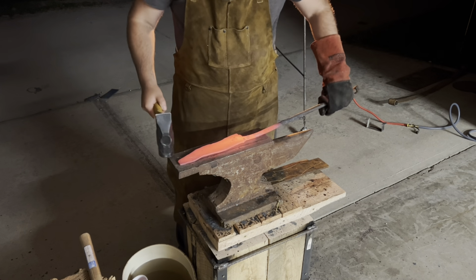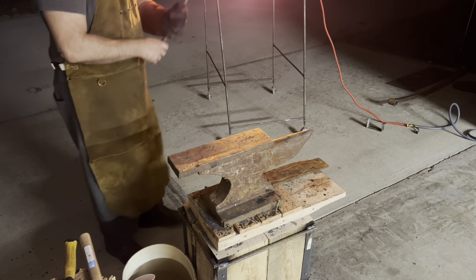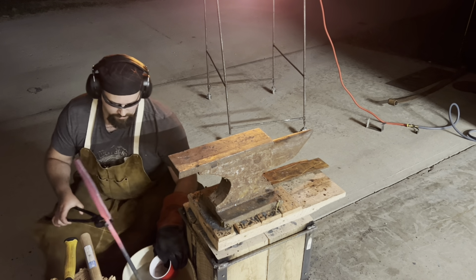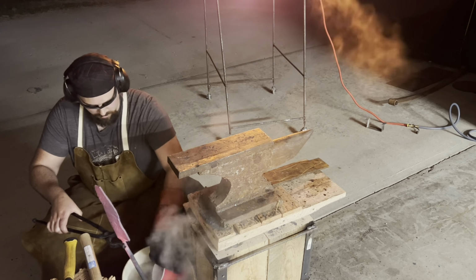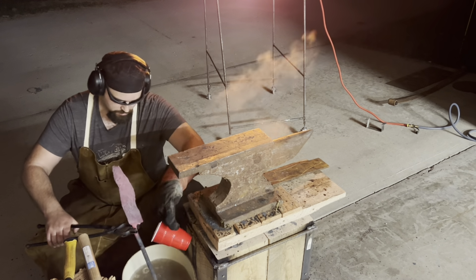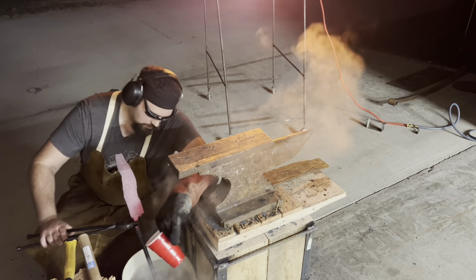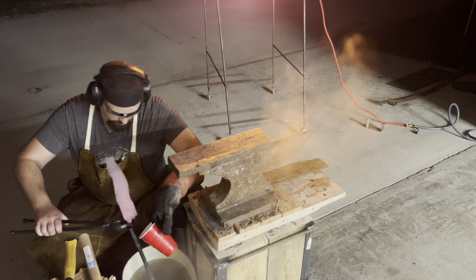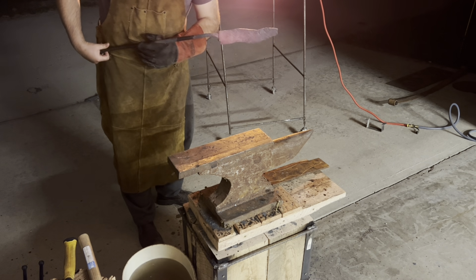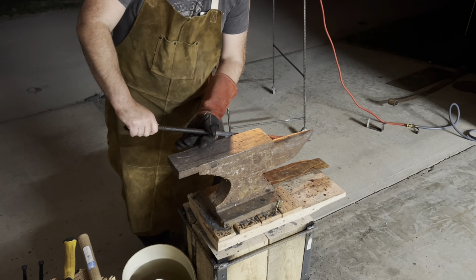For those of you that don't know what a distal taper is, if you look at a blade profile, like you would in an engineering document where the blade is just laying flat on the ground, you would see that there's almost a diamond shape between the tip of the blade and the tip of the tang, or the end of where the handle's at. Its thickest point is right where the guard fits in or the finger groove. It's right where the blade is no longer edged and the start of where you would hold it, or its handle area, begins. The reason that's supposed to be the thickest point in the knife is because that's typically the easiest point to break a blade if you're wedging or cutting or stabbing or doing any difficult work.